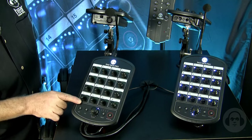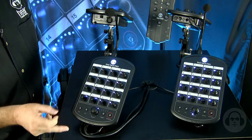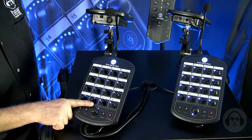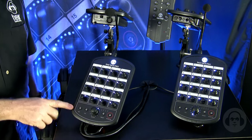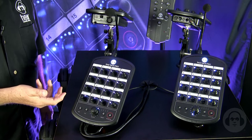So on the Pro, if you hold pan and just touch one of two knobs, they are now hard panned left and right, and they track each other no matter which knob you control. So you could actually have eight stereo channels instead of 16 monos, if you wish.